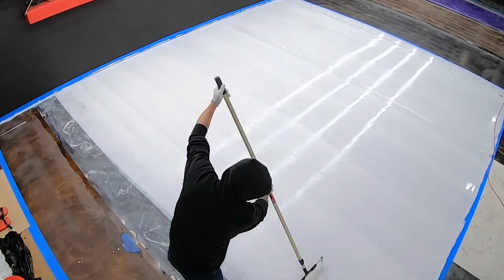I know our white epoxy covers extremely well, so I'm not worried about repriming this, but if you guys aren't sure or you wanna make sure, right, last thing you wanna do is recoat the floor and you can see random spots kind of through that next coat where the previous veins were, okay? So we're gonna coat this, it's ready to go, it's sanded. We're not gonna prime it, but again, it's always best to prime surfaces if you are unsure. That way you have a nice clean canvas to go over.